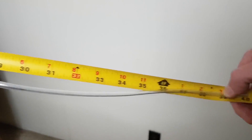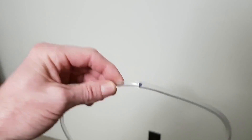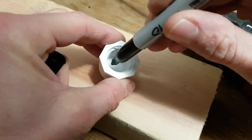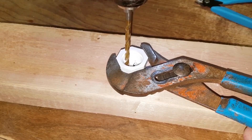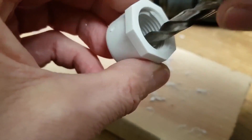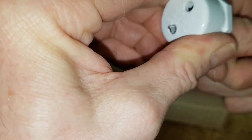I measure and cut the air line about 40 inches long. Next I fold it in half and mark the center. Drilling test holes in scrap material to trial fit the tubing helps me choose the correct size drill bit. I ended up using a 3/16 inch drill bit, which is a little smaller than the tube. The cap is now marked with a dividing line and two holes are drilled close to the ends of the line without damaging the threads too much. Using a larger bit, the sharp edges of the holes are removed and the burrs are cleaned up. Cutting an angle on the end of the tube helps when inserting it through the hole. Pliers were handy during installation.